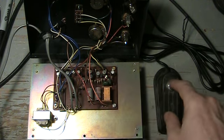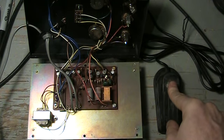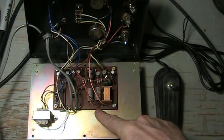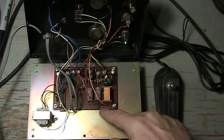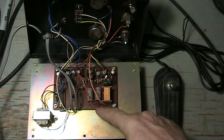When you push the bypass, you turn on the coil, and that drops the voltage. The coil draws so much voltage, so many milliamps, that it drops the voltage. It was dropping the voltage down to about 6 volts with the old coil. Now I think it's dropping it probably down to about 7.